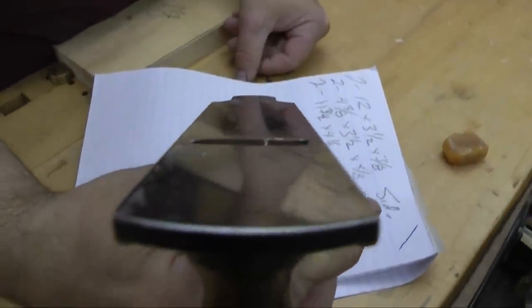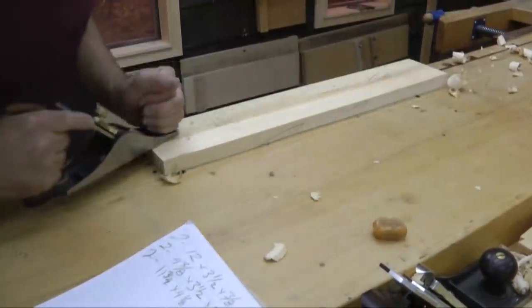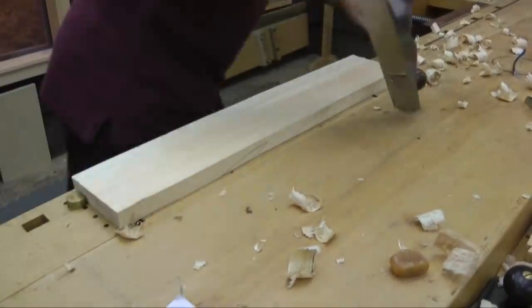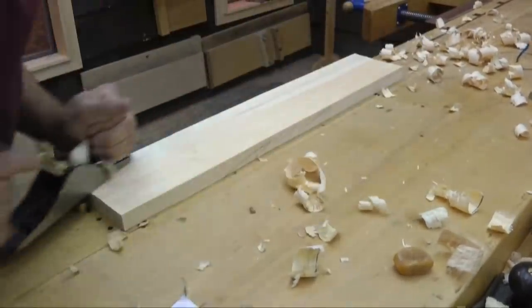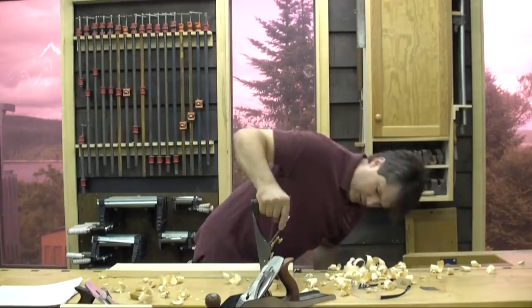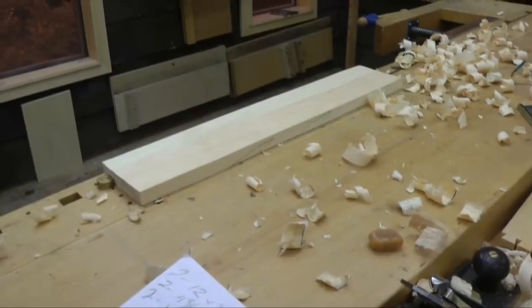With pine and straight grain I just go the full length. If the grain is changing direction, or on hardwood, I'll often go across the grain and do something we call a controlled tear. But I'm not getting any tearing of the surface, so I'll continue and just watch those reference lines. Eyeballing it — that looks pretty good, I don't see any severe dips or low corners.